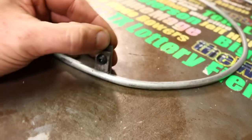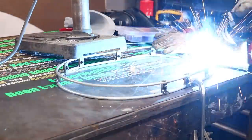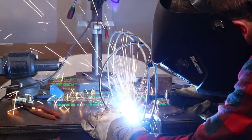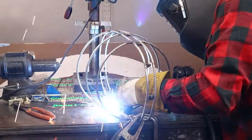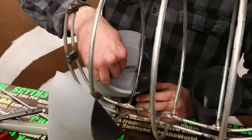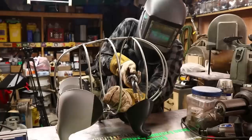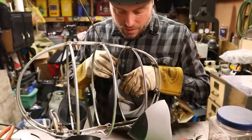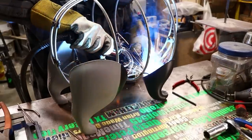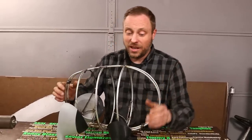And they need to be connected with screw together tabs so that once this frame's finished, I can get all the stuff inside of it. And then I used a ring roller to get the rods bent into perfect circles because Pochita's shaped like a potato and he's just round. And then I got a free model online and 3D printed the legs from it. And I just super glued those in place on the frame so that I was able to build a steel reinforcing structure on the inside of the legs, because I don't trust easily shatterable PLA to support the weight that's gonna be inside this. I'm super excited about this project now because this is turning out so cool.